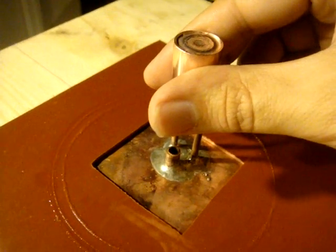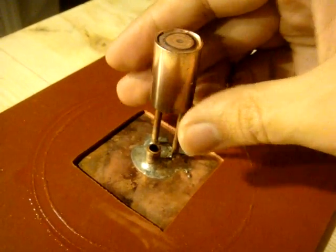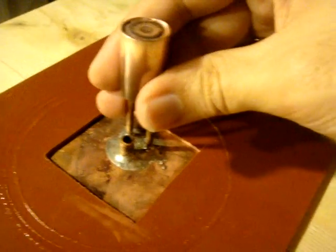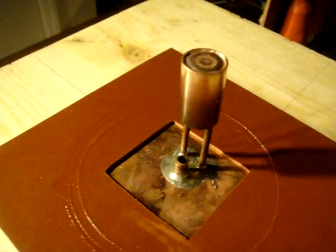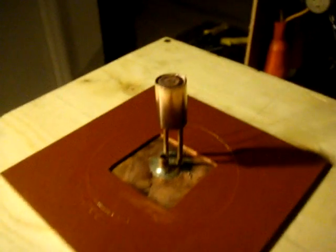The water really regulated the temperature and kept it cool, so it's a positive result with the water flow. Trying another deposit here — I have a glass test slide with a little adjustable plastic support suspended right above the magnetron target, and you can see we're depositing some copper.